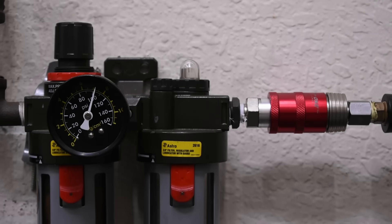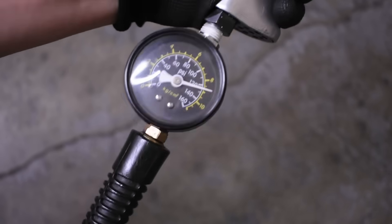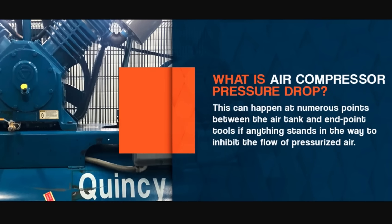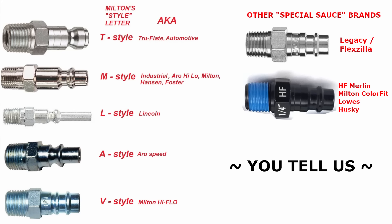The pressure we run this gun with is set as usual by adjusting the wall regulator until we see 90 PSI running in the tool — that's called dynamic pressure. For the best-case scenario test, we use 150 PSI static and that pressure level drops to whatever it does once the tool is running. If you're also interested in how different couplers and popular air fittings alone affect power on an impact wrench, let us know in the comments. We'd be happy to perform those tests if you want.